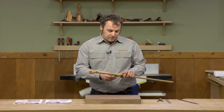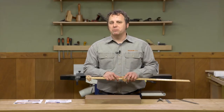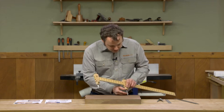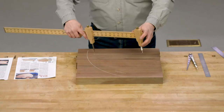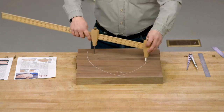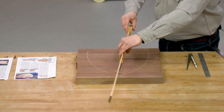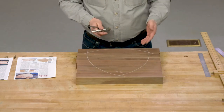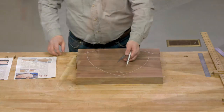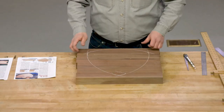Next, to create the overall shape, I'm going to readjust the beam compass for a 12 inch radius - all this information is provided in the plans. Starting again with our corners, I'll strike an arc on one side and then work my way around the three points. Because I don't want these corners of the seat to be real sharp, I want to round them off a little bit, so I'll use a smaller compass to blend those corners by creating another set of arcs. I really like this shape - it's got a nice pleasing look to it without being really hard and angular.